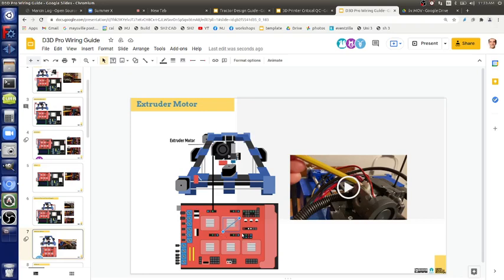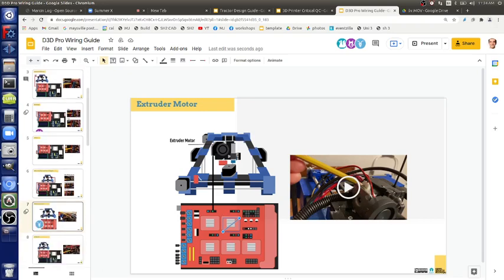I put a cross there because we're typically not using that. We only need four channels, not five. You'd be using that if you were using another driver. For some people, both this one and that one drive the Y, so you could connect to either. You can actually choose. In cases where some of the drivers were hard to insert at the bottom, we just put it at the top, because it's a little easier to insert at the top, since it's not sandwiched between two other ones and tight there. Gotcha. Next.